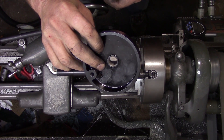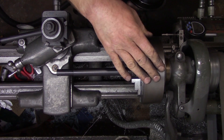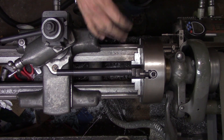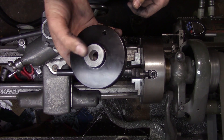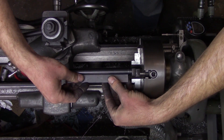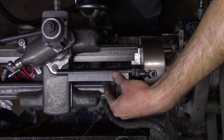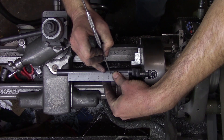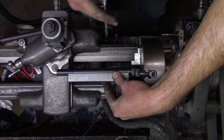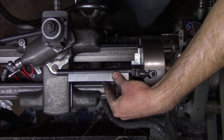I do not like this hand wheel so I want to eventually change it over to one more suited to my old lathe. I want to get one of the three-spoke cast iron hand wheels, so I'm actually going to cut it off a little long because I don't know how big the boss is on the hand wheel I'm going to be getting. I'm going to add two and a quarter inches to the witness mark from where the spindle ends, which gives me a little over half an inch extra from the current hand wheel and slip collar. So we'll just put a little mark on there.